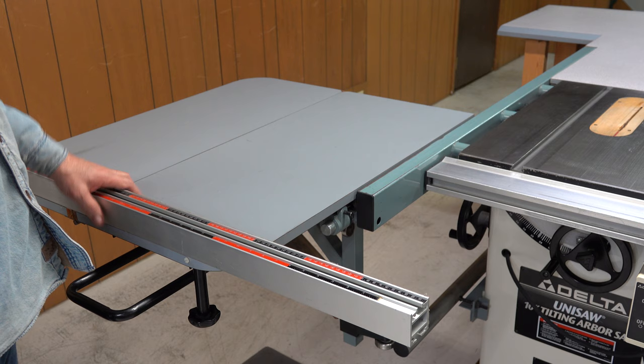For number 55, you can actually remove a little bit of the vibration in your saw if your saw has been sitting for a while. You'll have three belts on the backside, typically, of your pulleys. Now, I don't show them very well in there. But those three belts get a set because they've been stretched apart. So if you take your blade and rotate it just until the set is midway between the two, so now the blade won't go forward and it won't come backwards on its own, it's like hanging in the middle, balanced, if you will. Then you'll find that the set is stretching your belts out again. Leave that sit for a short period of time, and once you get started again, you're going to notice a lot less vibration.